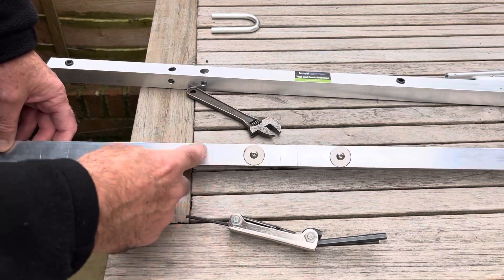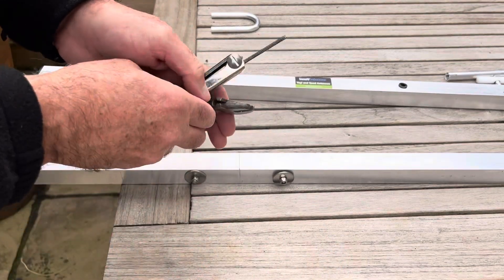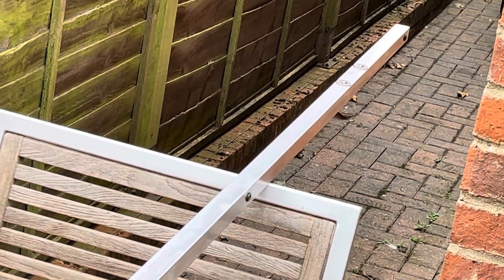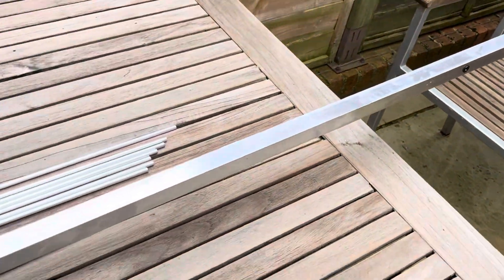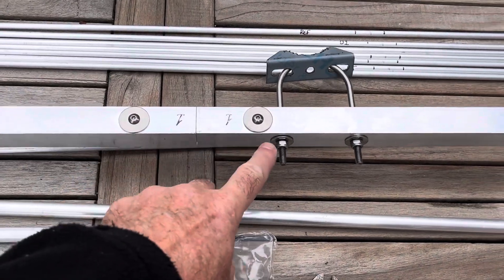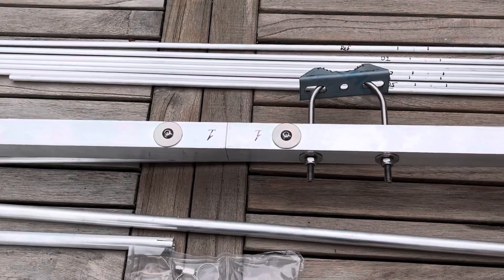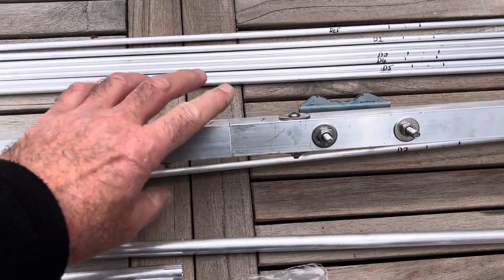We're attaching the end boom extension with stainless fittings, securing and tightening the nuts. That's the extension joint up there. I've made the two center connections — there's a round bar in there, that's the mast clamp, and that's the other end. It's looking quite big, hopefully still manageable. That's the joint I'll use to break it down in half, the other is permanently on.